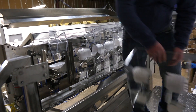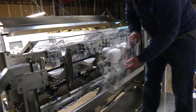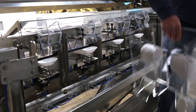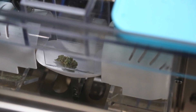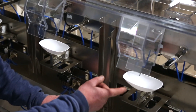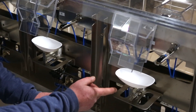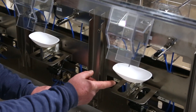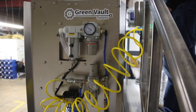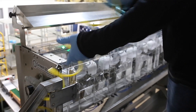Now you're ready to remove the weighing bins. Remove the weighing bins one at a time, pulling towards you and straight out. Remove any large pieces that might be left over. Be cautious with the weigh cup and the load cell, just like you would with any other high-precision scale. The Precision Batcher comes equipped with an air nozzle intended to clean off any residual dust.